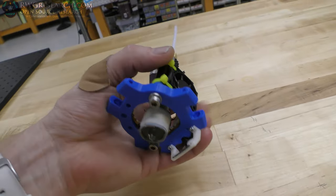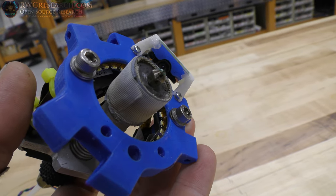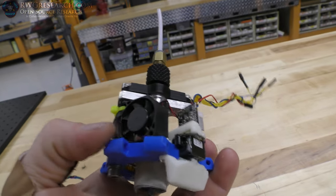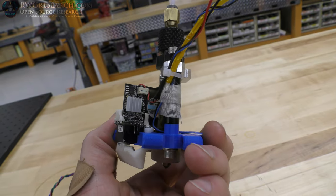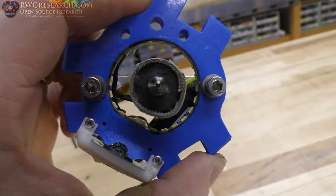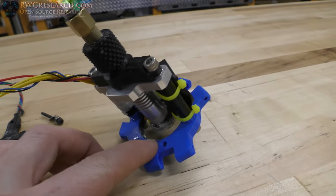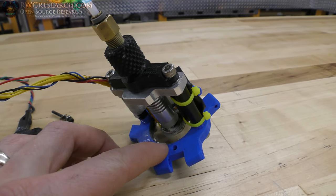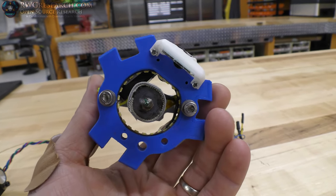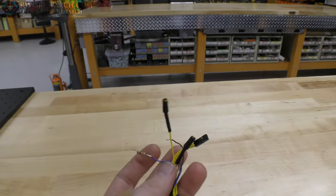I'll show you on a different video — I had this thing apart and I was working on it. There's the camera on there, and you can see how the camera peeks right past there. The colors aren't great on this right now for some reason. I just added this bigger fan — I had a much, much smaller fan on there, but this is temporary as a test. And there are lights — you see the lights on the inside? They're on a ribbon strip. If you take apart an LCD screen — the right ones, this is actually from an iPad — they have these LED strips that light the background up. I just took that strip off, wired it up properly, and connected it to a voltage-limited power supply where I can adjust it to the right brightness so I don't burn the LEDs out. I do have a resistor on here just in case I go too high.